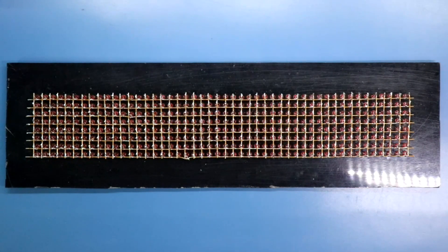This is the first column. So we have to connect all the positive pins of the LEDs. I'll solder all these positive pins. So this is how I have soldered the first column, and like this we have soldered all the columns — the positive pins. Per IC can control 8 columns. So we need 6 ICs on this side and 1 IC on the other side, totaling 7 ICs. So we need 7 connectors.